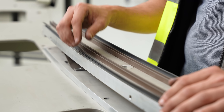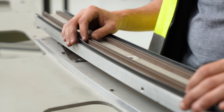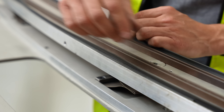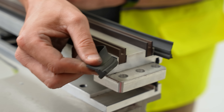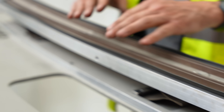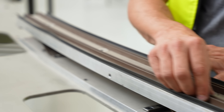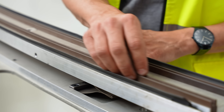The sealing system uses barriers in order to avoid the entry of dirt inside the motor. The first two barriers are the external ones — these seals are called T-seals, because of their T-shaped section. The other two barriers are the internal ones — these are special seals called main seals. They are more robust and they are fixed into the segment.